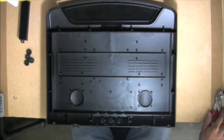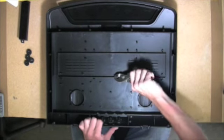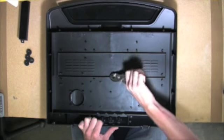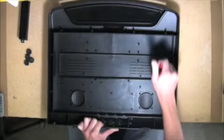Using a pair of pliers, carefully remove the lower wall surrounding the two air vents on the top of the canopy. Note that you'll hear plastic cracking, but this is totally normal, and the plastic piece will be removed later during the installation.